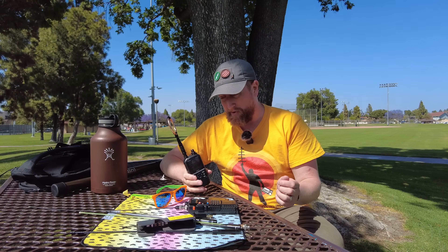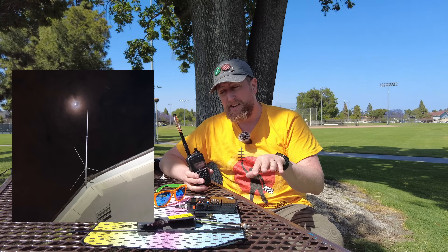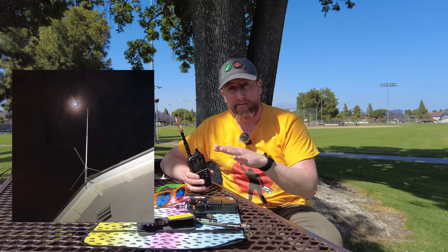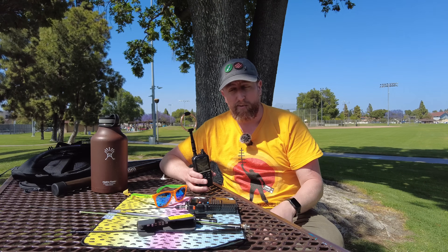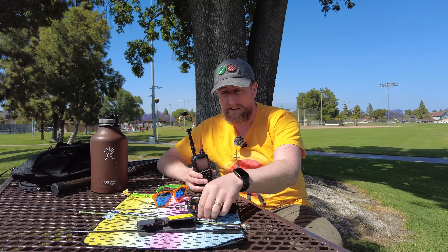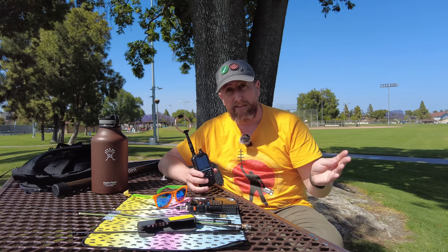I'm a little surprised on the reception test, but that's likely because I was using a handheld for the reception test back home — so at most five watts. That is on my home dual band antenna, my big 15-foot vertical. So it's likely that I need to put that on extra low power and redo this. I'm going to take the all-stars from these antenna tests and redo the reception test, because I think it's a worthy cause to see what the dropout rate is.